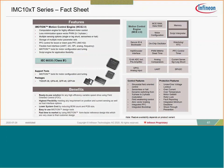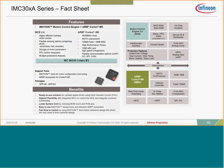The iMotion 101 series is a single-core device — a single Cortex-M0 processor. Key protection features built in as part of our UL qualifications include: under and over voltage lockout, over current, over temperature, motor gate kill, rotor lock, fault reporting, integrated minimum dead time, and shoot-through protection. You can control the parameters of these to match your motor and inverter solution. A number of different packages are available, from a 38-pin surface mount all the way to PQFN packages from 48 to 64 pins.